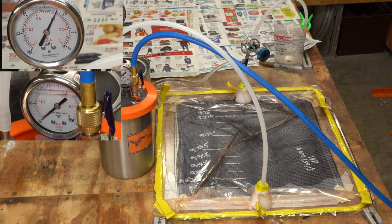Now, here comes the next little bit that's interesting. Now that I have closed the clamp on the input and that resin continues to get pulled toward the output port, you'll notice that the vacuum on the input gauge up at the top left corner will start rising and eventually it'll come up and reach the vacuum at the output port. So that means that that vacuum gradient that we've had along there as we were pulling the resin in is now starting to close. That vacuum across the part is slowly getting closer and closer together until what finally meets.